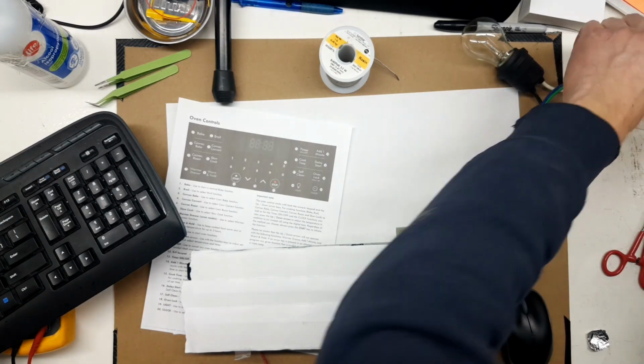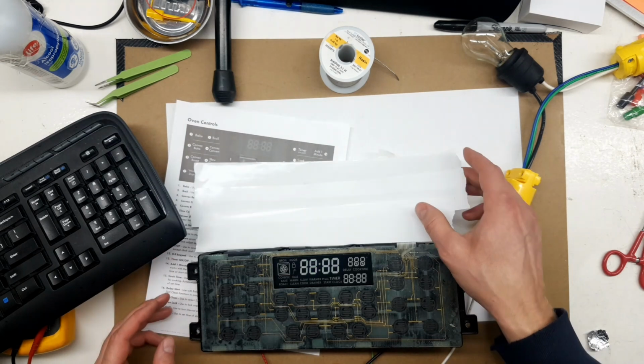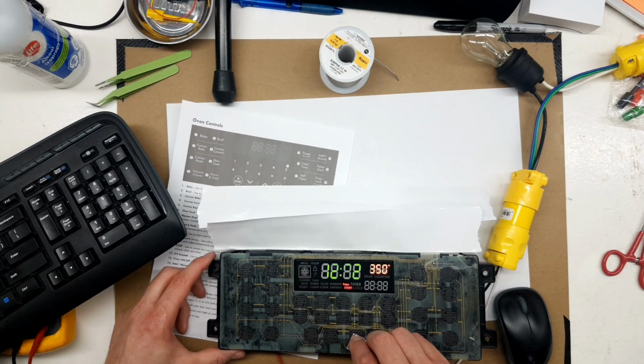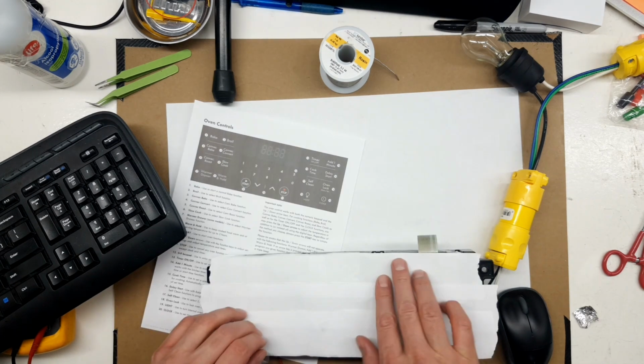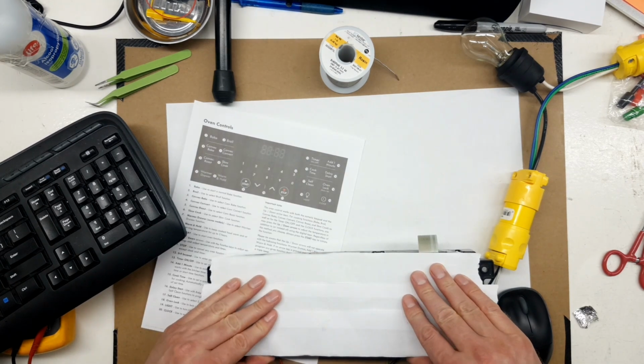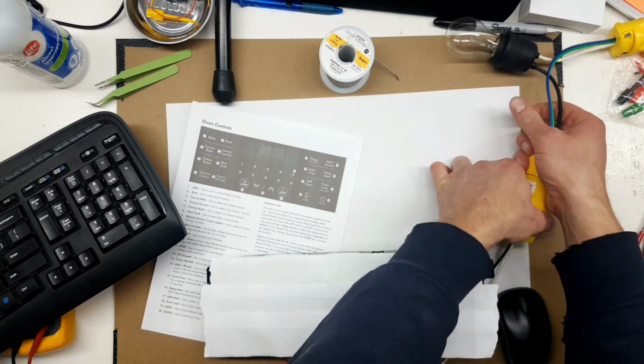So the control panel checks out, has control of the oven. It'll give an F30 code, which means there's no temperature sensor connected. But you can hear the relays clicking and it seems good. So we're going to call that a fix. And thanks for watching.